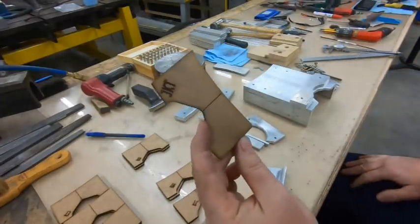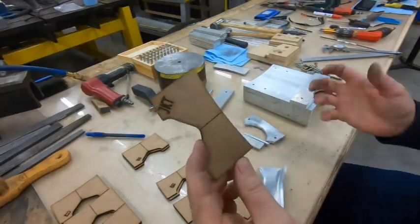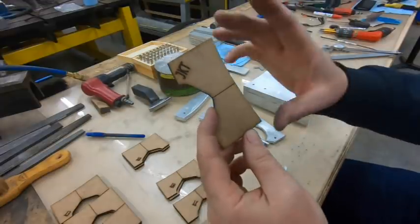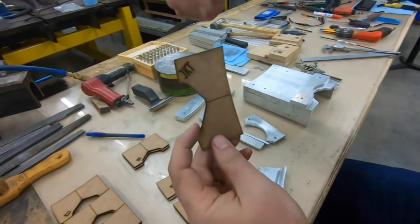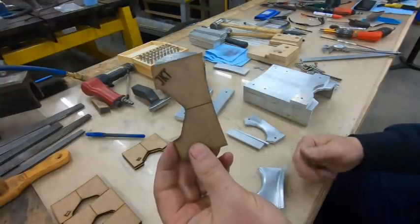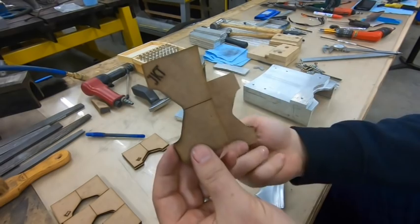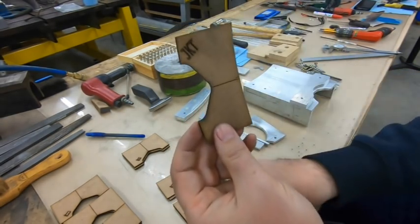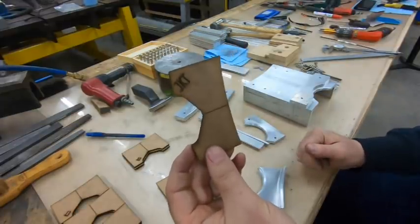I wanted to minimize the amount of tooling needed because these are small parts. They're quite tricky and you want them to fit perfectly. Basically what I've done is created tooling that allows me to mirror these. Both top segments are going to be mirrors of each other, and both bottom segments are going to be mirrors of each other, keeping our curves accurate. So that means I just need two special pieces of tooling per frame, which isn't too bad considering the alternatives.